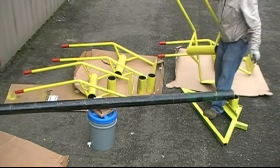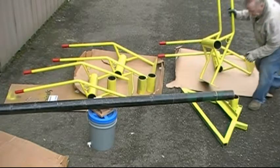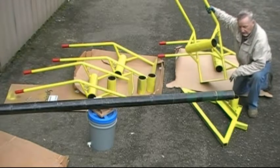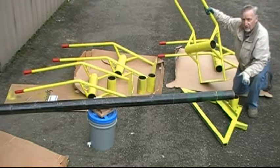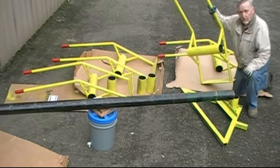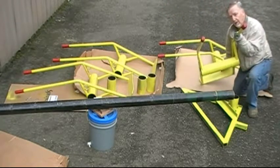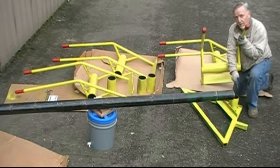It doesn't matter what order you take the axles in. However, you will notice that there's a bar on one side of the pivot support, and that's going to be a bar that a safety beam attaches to — one that these cradle arms will lock into. So the most important thing is to put the cradles on in the proper position, which is the plate base foot of the cradle should be on the opposite side of the bar on the pivot.